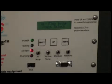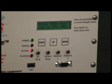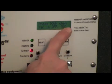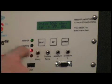The airflow setup screen was designed to allow you to recalibrate the airflow sensor. The airflow sensors may get some bend memory over time and change its set point. To set the airflow turn-on temp setting, press Select to enter the screen. It will give you the instructions to turn the fan off, and the numbers here show you the current resistance reading of the airflow switch.